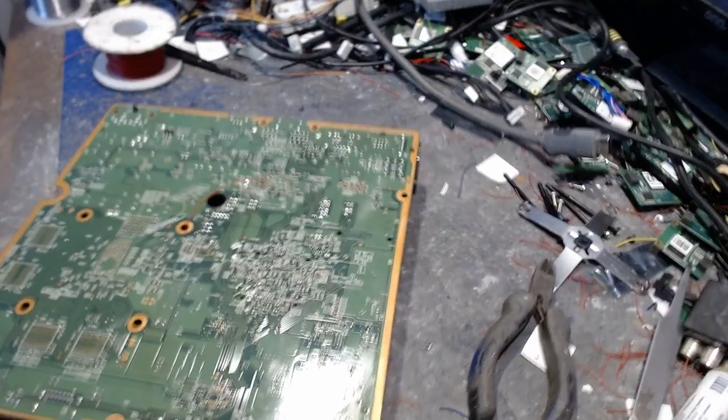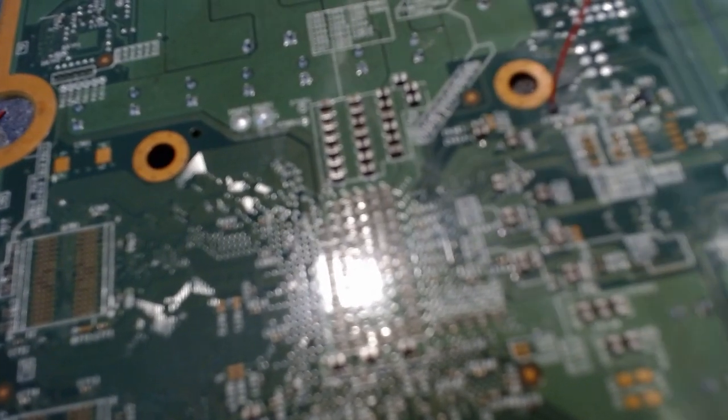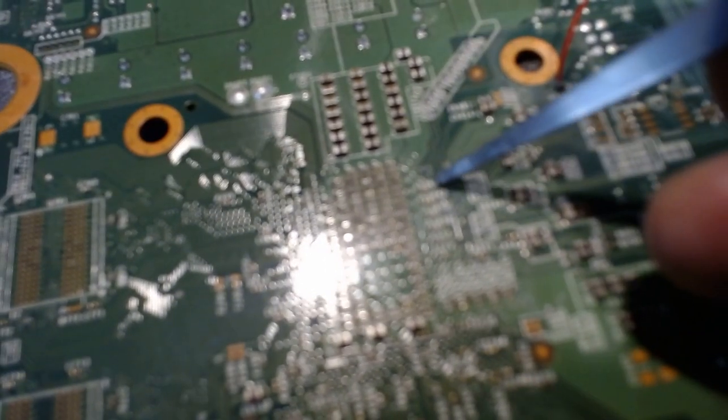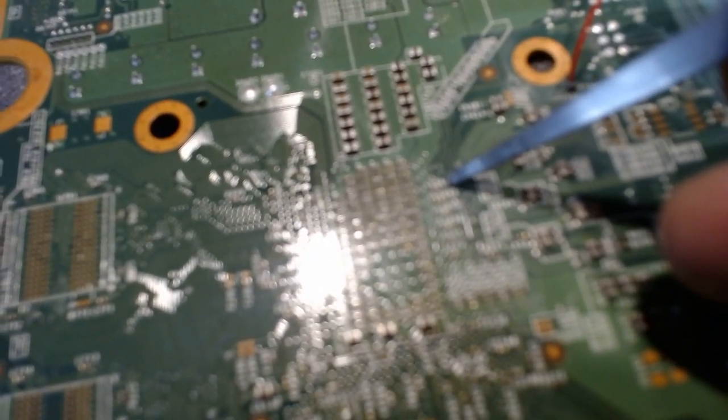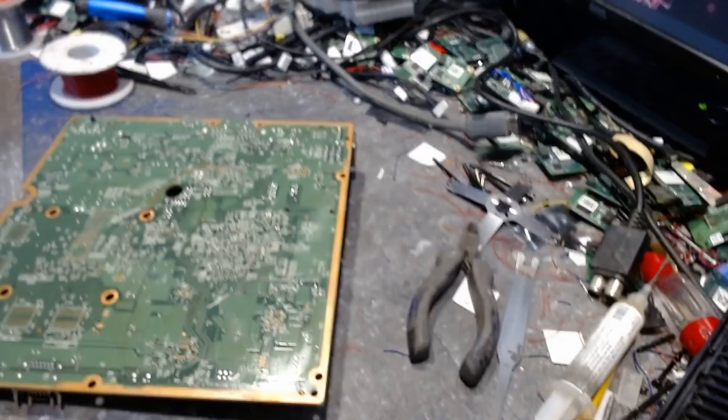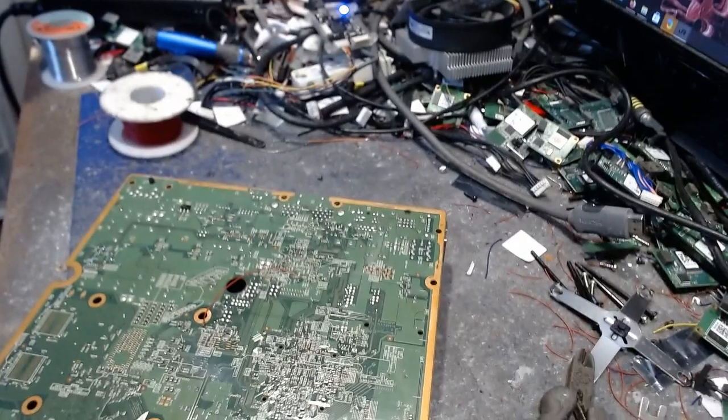Alright, now, this camera is not the greatest in the world, but it's right by CR35, which happens to be right here. And underneath that 3, where I'm pointing, is the PLL. Now, you're probably wondering how I'm going to scrape that out of there without hitting those other traces and all this other stuff, okay? Which is a pain in the ass, right?